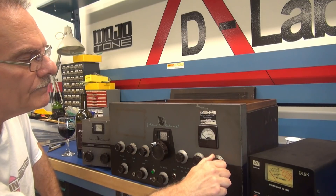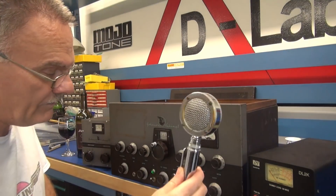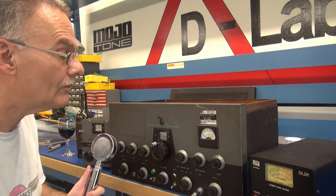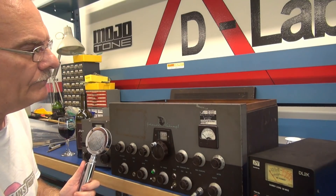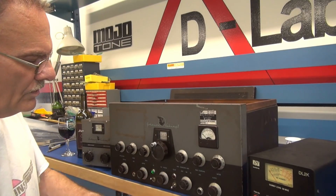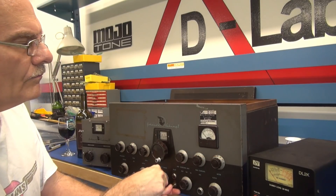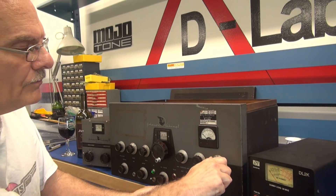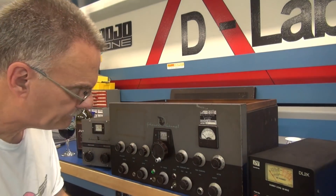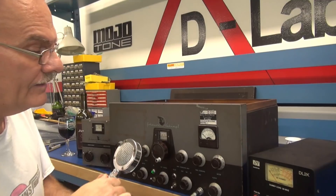I do have a microphone hooked up. I'm sure there's probably high voltage on that relay — it looks like the typical Ranger style. Let's try push-to-talk and see if we can dip the plate. No worky on push-to-talk, so we'll go with the plate switch. I did see a flashback on one of the rectifier tubes, but I'm not going to worry about that right now. We're getting 100 watts output and we're dipping. Modulation current is a little low, and push-to-talk does not appear to be working — that relay is probably smoked.